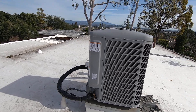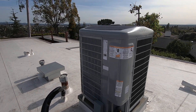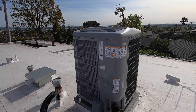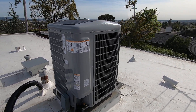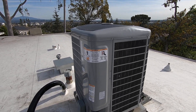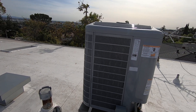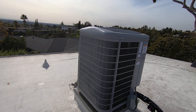This is also a two-wire design outside. It's fully communicating, so inside you have to match it with the Carrier Infinity fan coil and the Carrier Infinity control thermostat for it to work properly and run all of its speeds. This gives you communicating capability, Wi-Fi, and fan control — you can set your minimum and maximum airflow limits. It also has dehumidification functions, which make it very nice for keeping your house comfortable and even-temperatured.